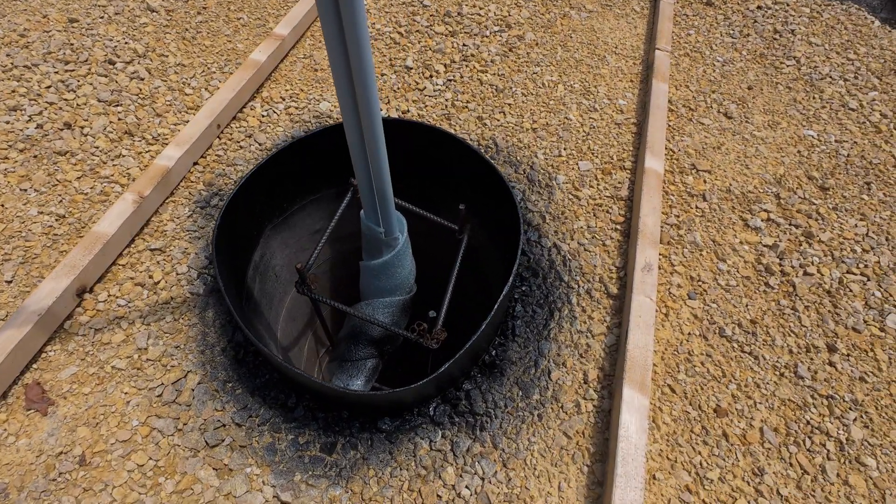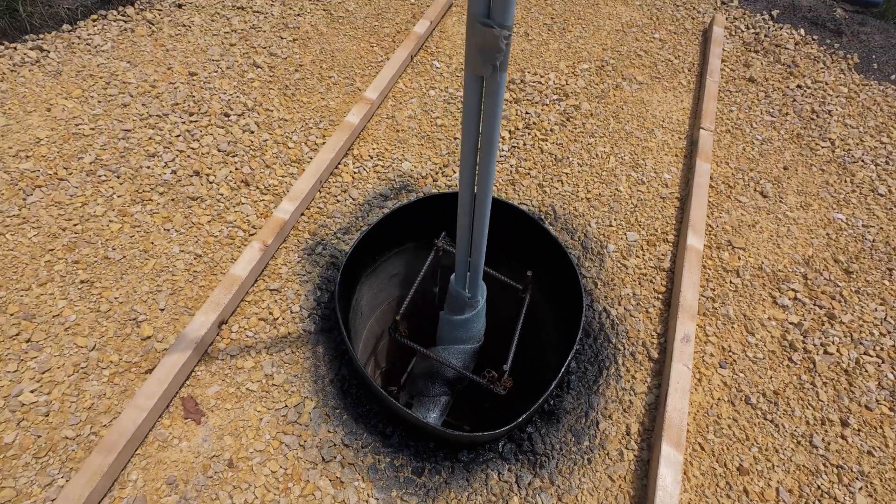I'm guessing that people are going to comment and ask why I don't have this formed up. That sonotube goes 40 inches down into the ground, it's setting on gravel. We got the height and then laid gravel down in there, lifted the sonotube up and got it set on compacted gravel. It was about one inch oversized — the hole we dug — fit the sonotube down there, got it all leveled up, and then filled the whole perimeter about a half inch on each side with sand to take up that gap. This thing is so locked in right now it is not moving. It doesn't need to be formed up in any way. All I need to do is wrap a couple of straps around the top to make sure it stays round and doesn't bulge out.